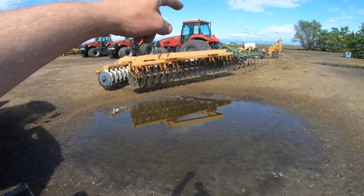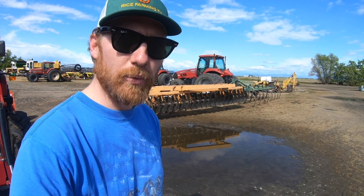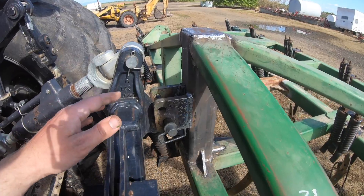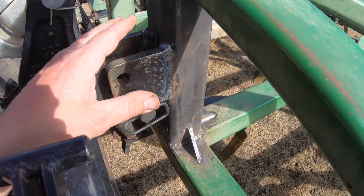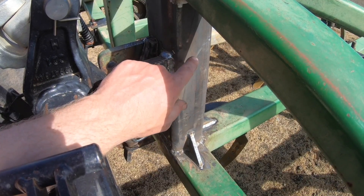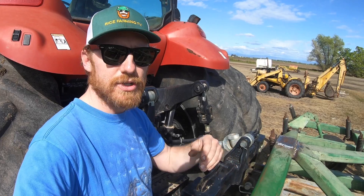Come on, let's go take a look. The repaired three-point chisel is right there on the Case 245. So it's hooked up right now, but let me just show you. Big difference from what it looked like two days ago. I think Rick's going to be surprised when he gets back and sees it already in tip-top shape. Some extra features we added: thicker wall tubing here, and also three gussets around the base of this tubing. This entire thing should be a little bit stronger. It also ripped apart because the three-point was jamming and gouging out the side of the tubing. Hopefully with thicker tubing we'll prevent that. Jerry did a fine job.